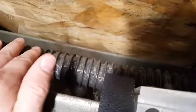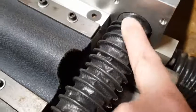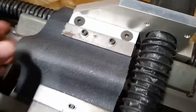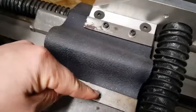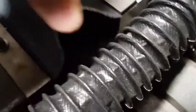It's covered on the back side but loose again. I used the large cover back here but didn't buy a piece long enough to cover the whole thing, so I used the same smaller cover that I used on the x-axis. The x-axis covers are just tucked up in the hole — zip tied on this end to the ball nut, so it's a good solid cover. This is a piece of rubber from a treadmill belt, and this screw goes into the original hole, and these two screws go into that block I put across there — it provides a way cover to keep dust out.